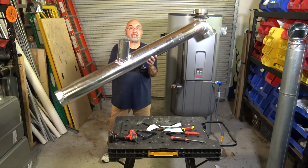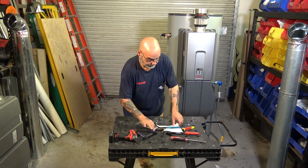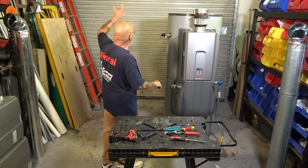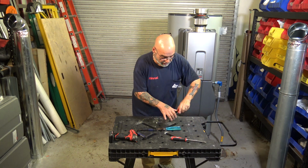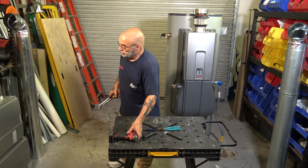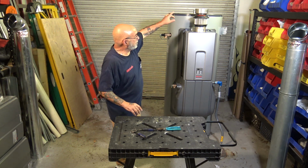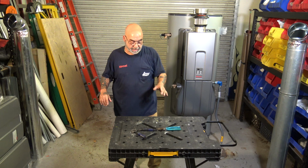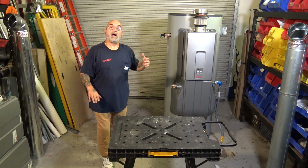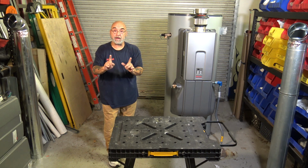Now that you would be doing with 6" into the B-vent. So that's your venting. Remember, 1/4" pitch. Oh, also, you do not have to put the condensate drain off of it. The temperatures of the flue gas have been raised on this system, so any condensate will evaporate. Plus, with a chimney, it's a little bit different than the actual RL style units. Okay?